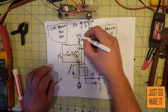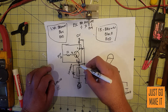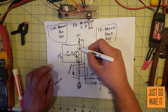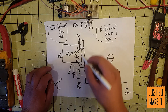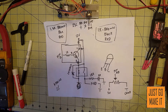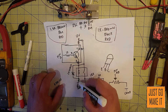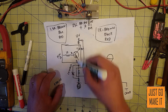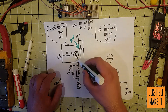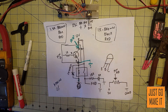We're cutting our connection here and then connecting our 12 volts to there. So our 12 volts comes from our power supply, goes into the relay and also into the top side of the coil of the relay. Now our collector of our transistor will connect to the other side of our coil. Coming out of our relay here, instead of going to ground, that is going to go into here, and then this side, when we come out of it, we're actually going to ground.